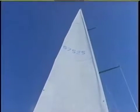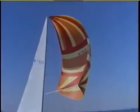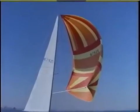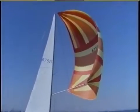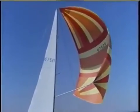When the wind is aft of 90 degrees relative and you have a spinnaker set, it may be impossible to get all the leech telltales flowing because the wind angle is just too far aft to avoid stalling. In that case, use a full shape and the same amount of twist as on a close reach. Disregard the top telltales and simply ease out the sheet enough to keep the luff on edge.